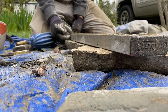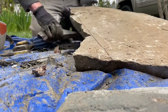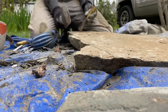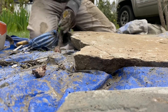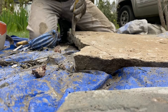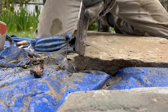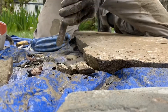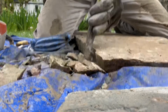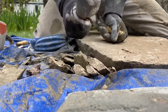Using the exact same principle, here I'm going to make a nice natural face on this piece for a stair tread. First I just scribe a line across with a straight edge, and now I'm taking the stone back in tiny pieces — less than an inch — just to make sure I don't break the stone in a spot I don't prefer. Those little pieces come off nicely; you just have to get into a rhythm of chiseling and slowly take it back to that line. That'll create a nice natural chiseled edge.